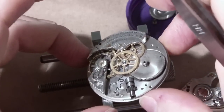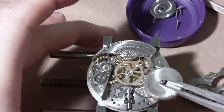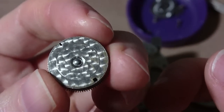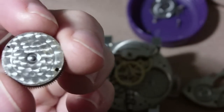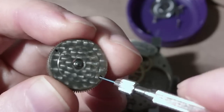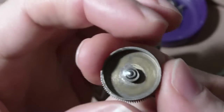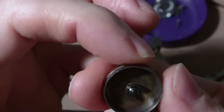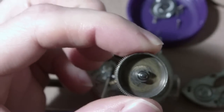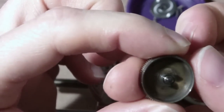Let me put this back down. As you can see, there's the mainspring barrel, the center wheel, and third wheel. I'm going to take this out — there's the barrel. One hole is for the clearance on the mainspring and the other hole is to pry the cover off. I'm going to do that now. I've got to see which way this mainspring goes in. I'm going to write this down so I don't forget. Looks like the mainspring goes like this — I think so, I hope so.